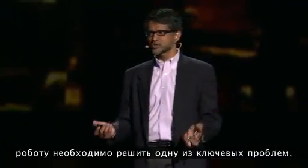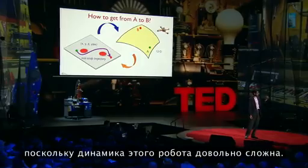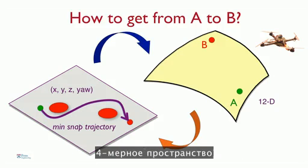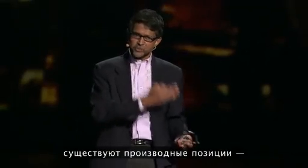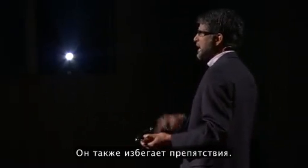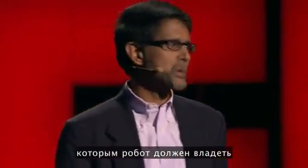One fundamental problem the robots have to solve if they are to be autonomous is essentially figuring out how to get from point A to point B. This is challenging because the dynamics of this robot are quite complicated — they live in a 12-dimensional space. So we use a little trick: we take this curved 12-dimensional space and transform it into a flat 4-dimensional space consisting of x, y, z, and the yaw angle. The robot plans what we call a minimum snap trajectory. To remind you of physics: you have position, then velocity, then acceleration, then jerk, and then snap. This robot minimizes snap, which effectively produces smooth and graceful motion while avoiding obstacles. These minimum snap trajectories in the flat space are then transformed back into the complicated 12-dimensional space, which the robot uses for control and execution.